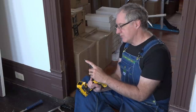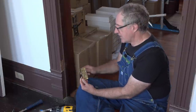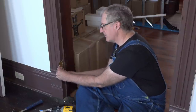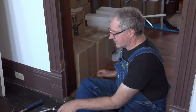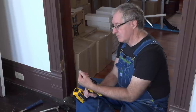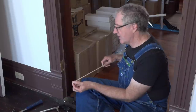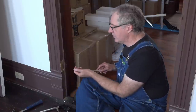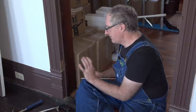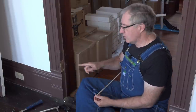We chose this replacement hinge because it has the same hole pattern as the original, but the locations are slightly different — when you lay it up here, you can see the holes don't exactly line up. So here's what I'm going to do: I'm going to take this quarter-inch drill bit and drill out the old holes. Then I have this quarter-inch diameter dowel — after I drill the hole, I'll cut off a piece, put some glue on it, put it in the hole, and let it sit. What that does is restore the wood to solid condition, and then we can go back and drill new holes for the hinge.